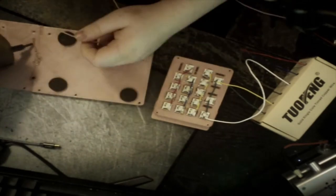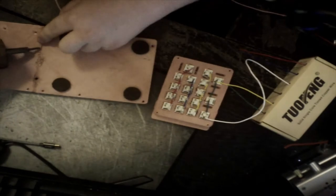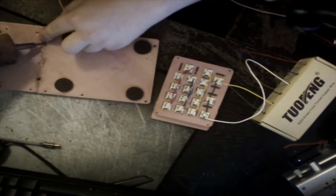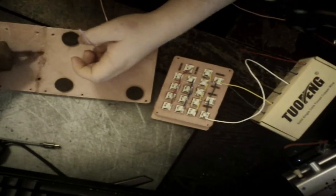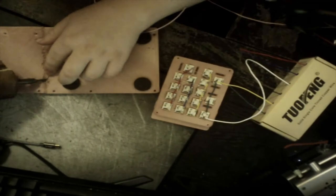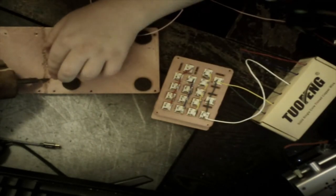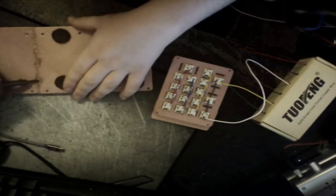As you will see a little bit into this time-lapse video, I am showing you how I welded the two boards together. It's an old 3D printing trick. All you have to do is melt the plastic in the middle of the seam of your print, and you can even use a little bit of extra filament that you have from your roll to add a better bond, or to fill in holes you may have made through this process.